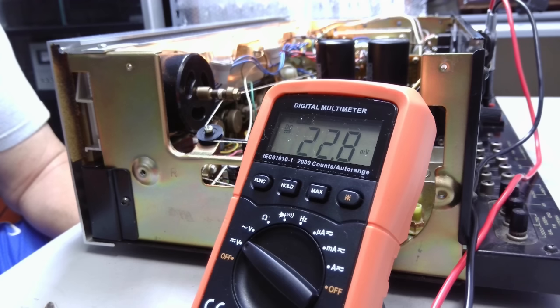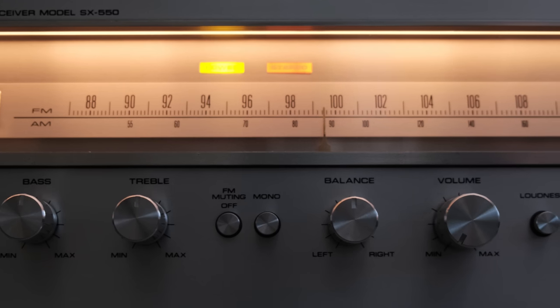Fortunately, it's an easy and cheap replacement. You can use two 2SA992 transistors to make the equivalent of the 2SA798, and that's what I've done here — combined two 2SA992 transistors to replace the bad 2SA798. I also gain-matched both of the new transistors, which is very important. I do it with an Atlas DCA Pro. With the bad transistor replaced, the DC offset on the left channel is now reading just about what the right channel did — between 20 and 25 millivolts.